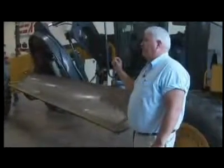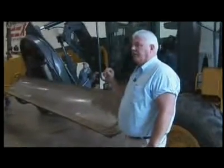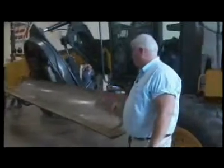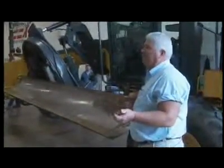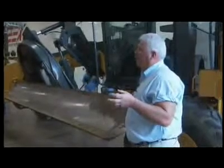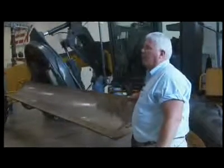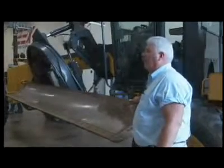If you look for evidence of just a little weepage — maybe ever so subtle, just a little bit — and there may be a little dust collected from the day before you run the machine, you probably shouldn't be seeing that grouted in and dusted in around a dirty fitting like that. If you do, you might want to take it under advisement that it could be starting to get loose and getting ready to blitz. That O-ring will hold pressure up to the point until you get flow, and once you get a pretty good stream of oil, that oil under pressure will cut that O-ring — it'll actually erode it, blow them out. They will not tighten up and reseal. A lot of guys will try to put a wrench on them hoping they'll reseal and they won't. It's going to require shutting the machine down, releasing the hydraulic pressure on that circuit, and replacing that O-ring before it'll ever tighten up.